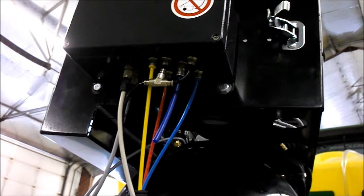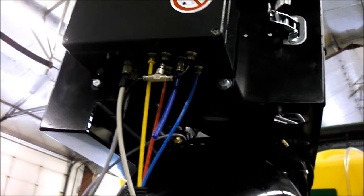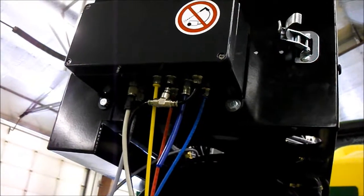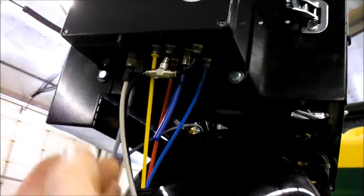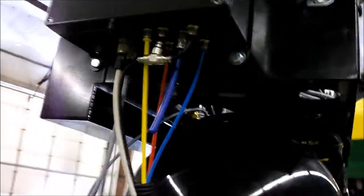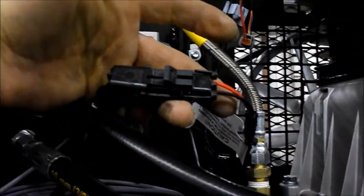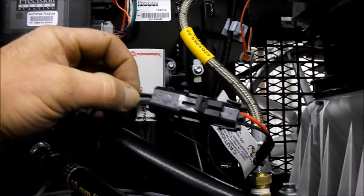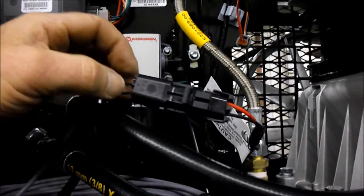The power coming from the monitor in the cab comes to the back port here on this box and plugs right in, so you want to have the distance right for enough length on the cable. Your power wire that feeds the whole system is this front position here, and we hooked it on the supply we pulled off the precision planting and just plugged it into their electric connection here. The wires are not marked as positive and negative, but one wire has a number 1 printed on it, and that's positive. The number 2 wire is negative.